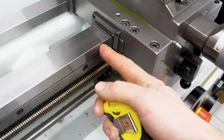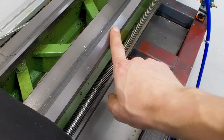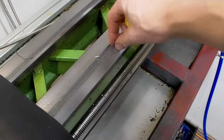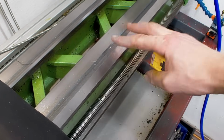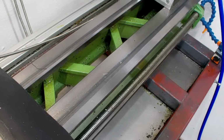If there occurs wear on these surfaces here on the sides, you have to adjust, and you can get into problems where the ways are loose in one spot and tight in the other spot. On a prismatic way like this, it's self-adjusting, because when you have wear on these surfaces or on the mating surface on the bed slide, it just drops down further onto the bed, but it's still free of play. Of course, it can still rock if it wears like a pillow, or it will also influence precision, but it will not have side-to-side play.